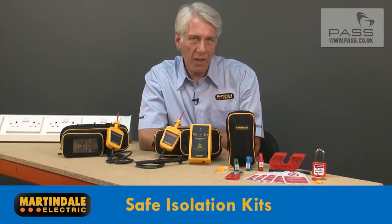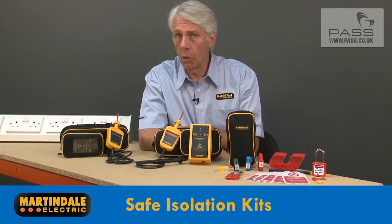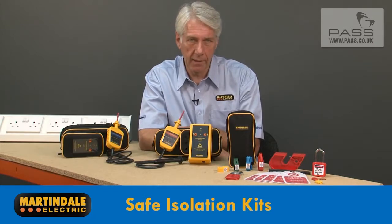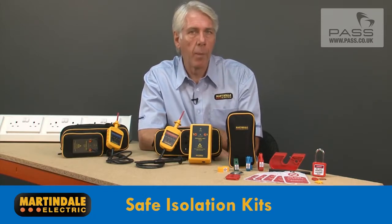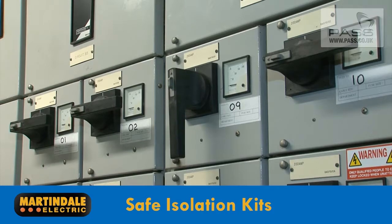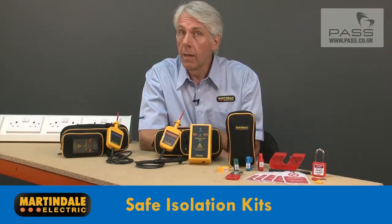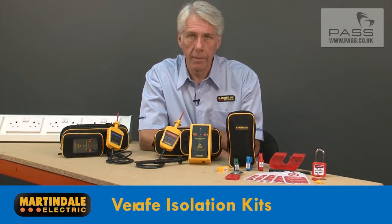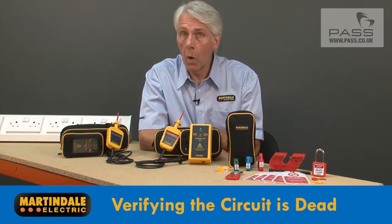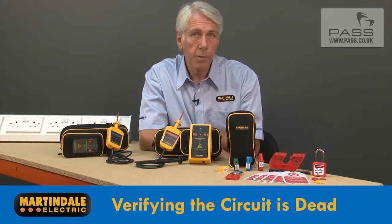No matter where you work, whether in a factory or someone's home, it is essential that you avoid working on or near live conductors. This is a requirement of the Electricity at Work Regulations 1989. And it's much more than just about switching off. It's also about preventing the supply from being inadvertently reconnected by someone else, possibly with you on the other end. It's also about verifying that the circuit or equipment you're working on is actually dead before you start.